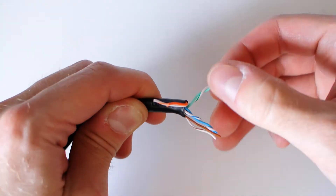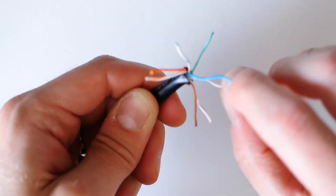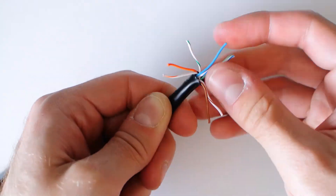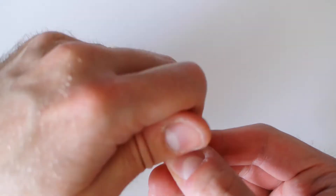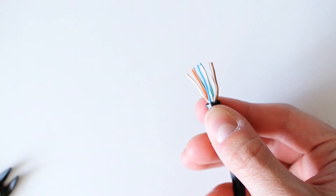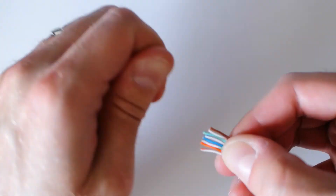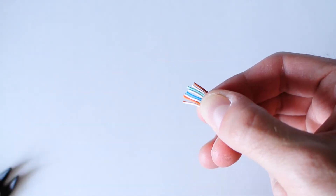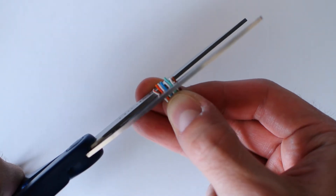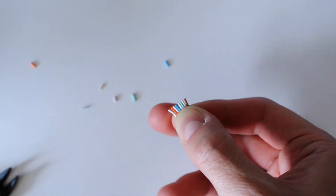That color order is important — make sure you aren't accidentally flipping one or two of the wires, because if you do, the cable won't work properly. I'll include a link in the description to a diagram showing the color order and how it fits in relation to the end you're crimping on. Now that you've got them in the right order, you're going to want to trim them flush — I use the scissors for this, as it gives a cleaner cut. Leave about a centimeter of the actual cable sticking out from the jacket. Any more and the connector won't grip the jacket for strain relief properly; any less and the conductors won't reach all the way into the pins.